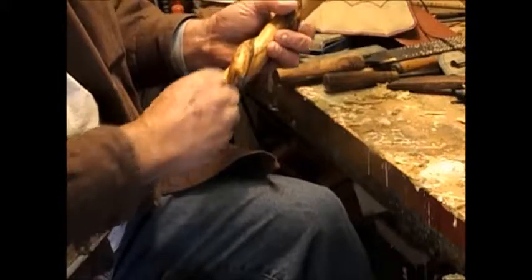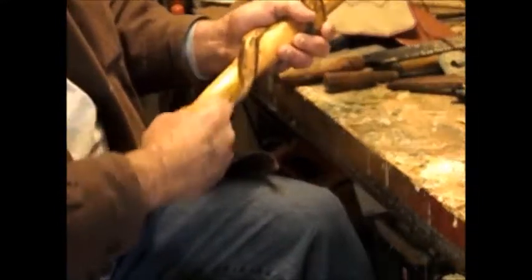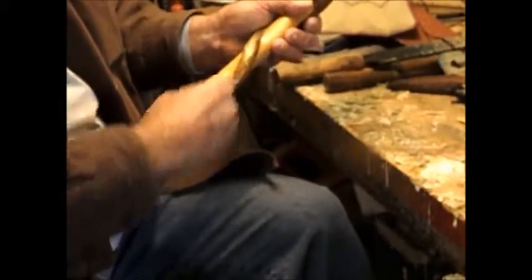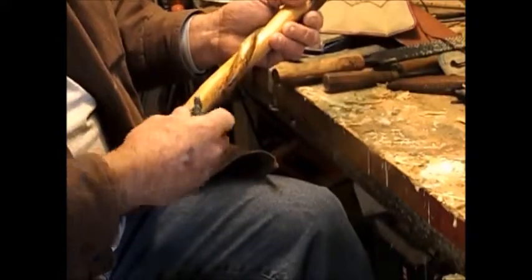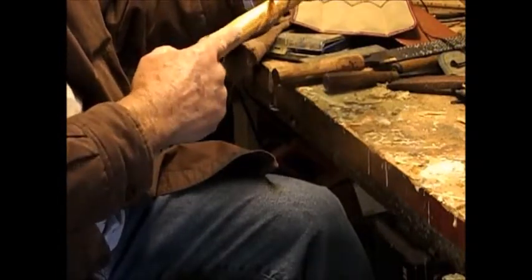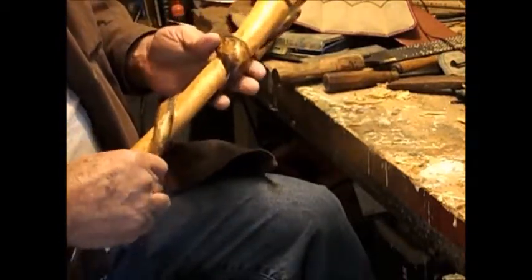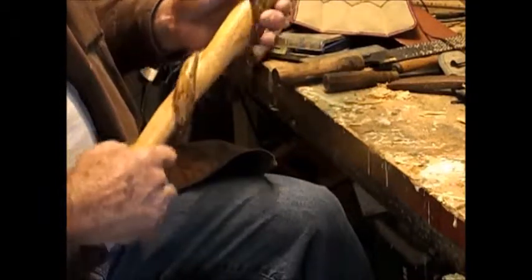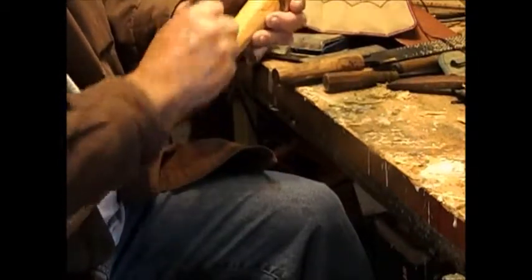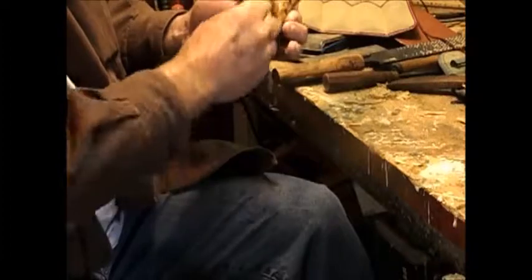You don't want to put it on in large clumps. In between each coat, you have to rub it down — thus the term hand-rub lacquer. I'm using triple-aught steel wool. You can see the areas where I haven't done the rubbing yet — it's shinier. The areas where I have done it have a satin finish. You have to rub out any imperfections, dust, any nap the wood has brought up, and buff it to a smooth, satiny-looking finish.